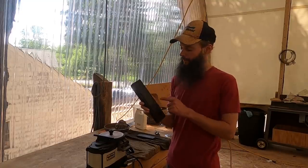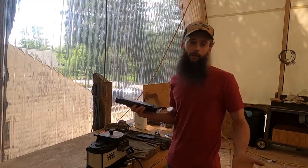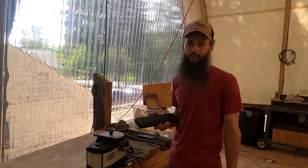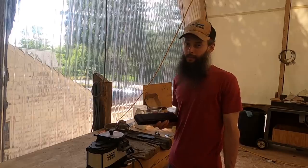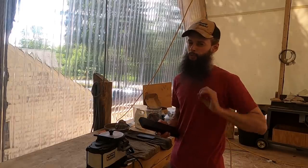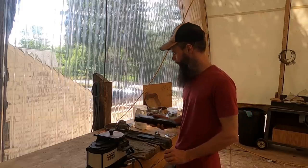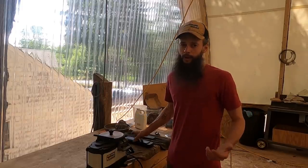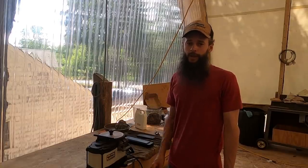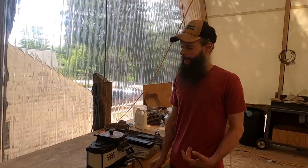Arkansas stones. So this one is a natural stone, and I don't know what grit it is. It's so old, it doesn't correspond to any of the modern stones. It's pretty fine, works well. I've got one that's even harder and finer that I use if I really need to get something super sharp. But since we started doing the boat, and just working white oak and black locust constantly, it's a little slow doing it by hand, although I do get better results by hand.